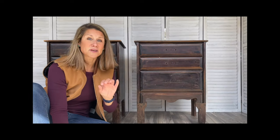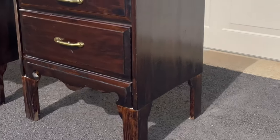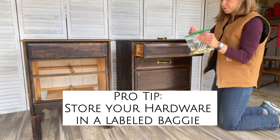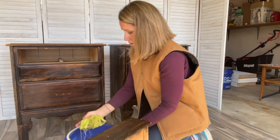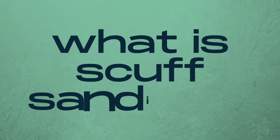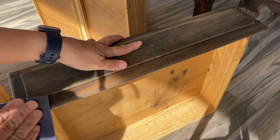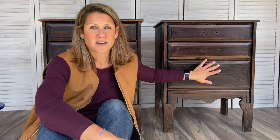Today I'm going to talk to you about scuff sanding. As you can see, I've got a great set of vintage nightstands behind me — they were gifted to me from a friend. I've already removed the hardware and cleaned them up. So what the heck is scuff sanding? You are scuffing up, or making little tiny scratches on the finish of your piece, in order for your paint to have something to adhere to — refinishers call this giving the piece some tooth, something for your paint to grab onto.